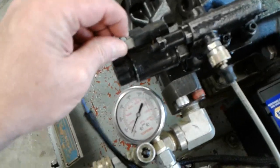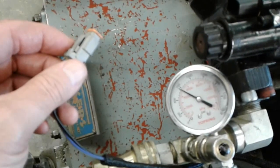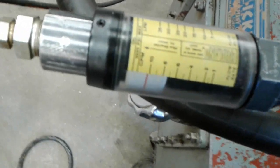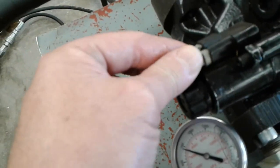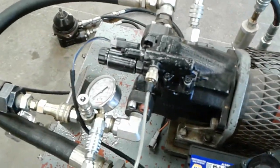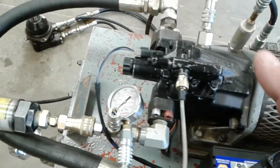And that's where I'm going to see it's not even 750 PSI is the pressure being caused by the motor. And I'm actually kind of exceeding the rating of my flow meter there, putting a little more than 10 gallons per minute through the system. So that, in a nutshell, is how the electronic control of load sensing works.